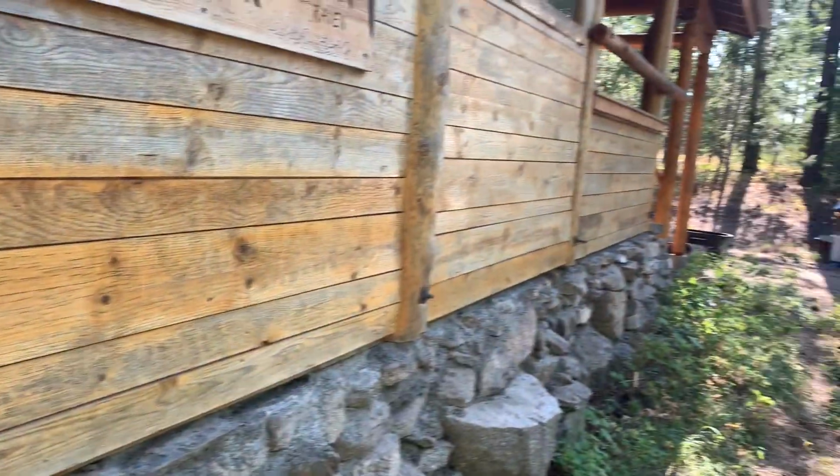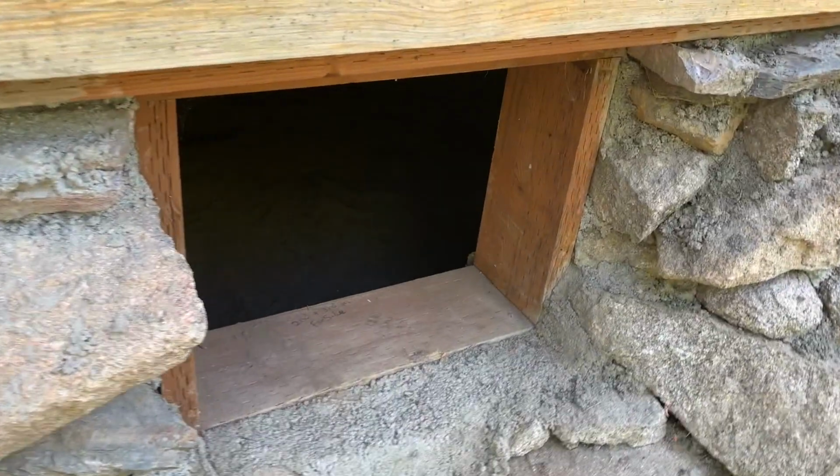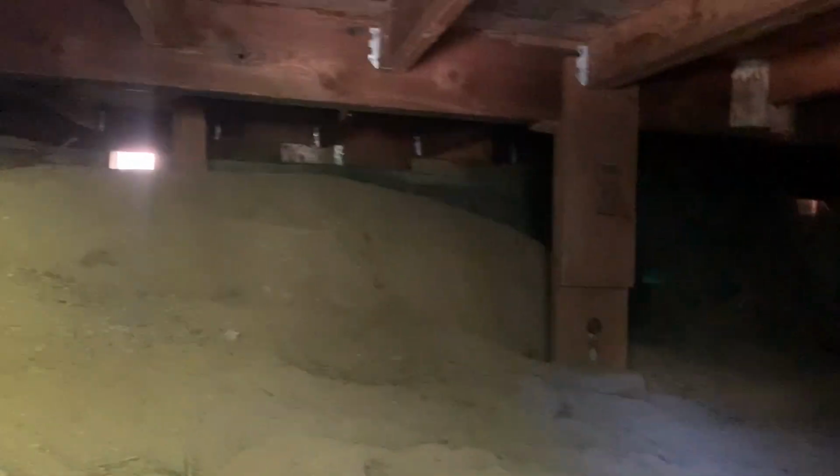And here is our tiny crawl space that we're gonna go in. Inside, we got maybe up there, maybe 2 foot of clearance, and then down here about 3 foot. And then you can see our wire drop down from before. And then what we did is just plumbed it all the way across. And then punched into the kitchen. We're gonna do the same with this 50 amp.